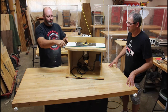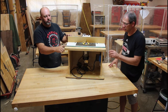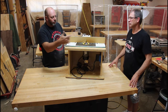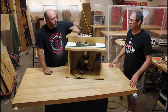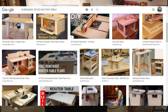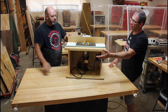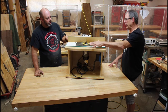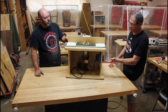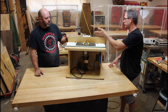If you're building your own router table, we made this slot using a router with a guide fence, then installed a pre-purchased track for about $10. Another useful accessory is a feather board or fingerboard, which holds material against the fence. This DIY table is semi-portable and inexpensive, has a larger flat surface than the store-bought one, a safety switch for $10, an adjustable fence that goes both ways, and dust collection.